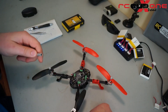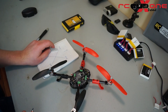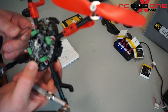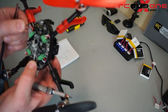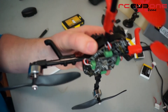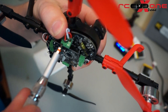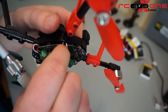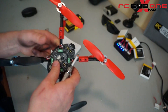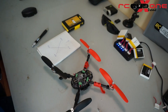After that, switch your bits out and attach your motor wires in the correct orientation — refer to the chart you made initially. This is where the tweezers come in handy. Realign your wires with the hole; there's a small hole at the bottom of the connector. Hold the wire into place and set the screw. You'll know you've set it properly if you give the wire a tug and it does not come out. Repeat that step in the color coordination you've already documented all the way around, and that will complete the flight controller swap for the RCI-1 Xtreme.